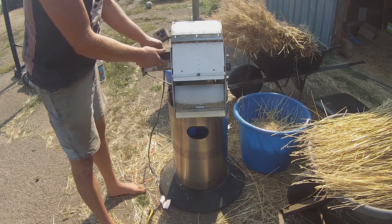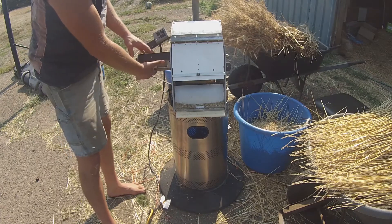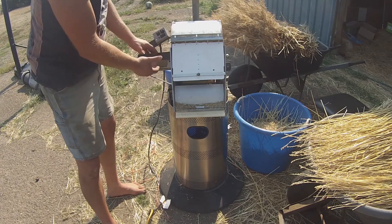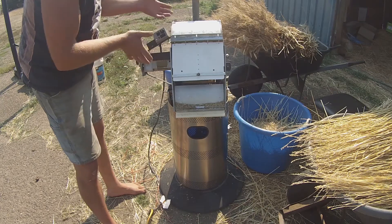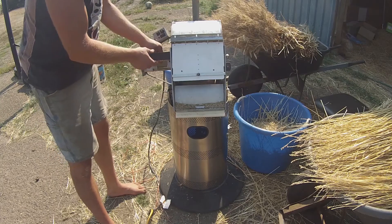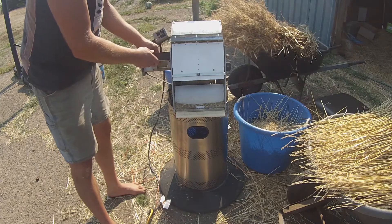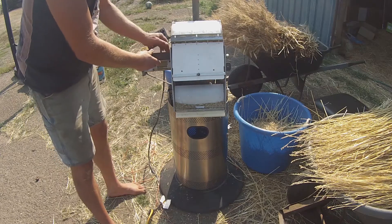The original motor was far too fast for this application — it's made to kick air out and doesn't move any air at all now, even though the blades are still there. What I've got here is a motor and gear drive mechanism from an office-duty paper shredder — heavier duty than a home-use one. It works quite well; it's about 65 RPM once it's all said and done.